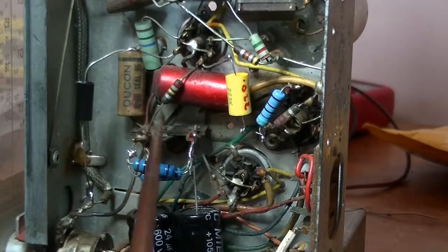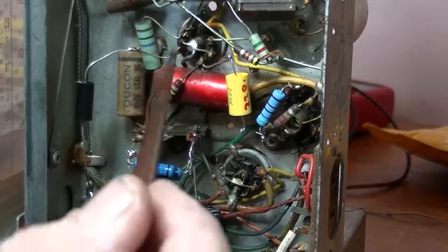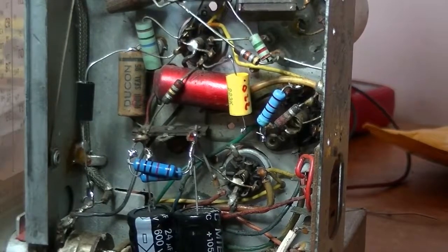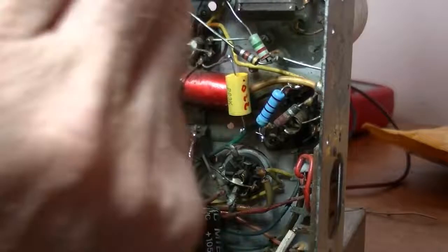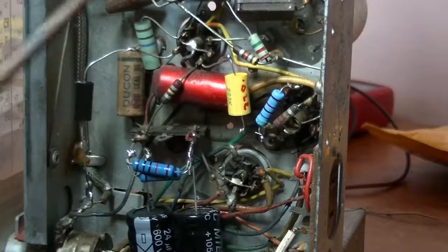I will leave a little bit of the existing lead wire, and then I just create little J-hooks on each end, crimp them together, and solder them up. And I just work methodically through all the caps. And run a test, and I will do a couple and then come back.